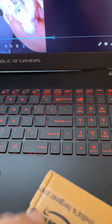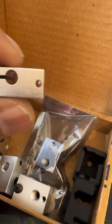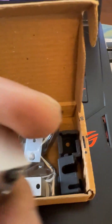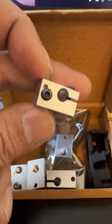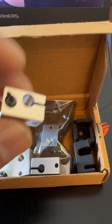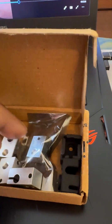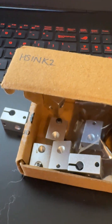I made this mistake so you don't have to. This is a heat block which takes the cartridge type thermistor, and here's the heat block which takes the glass type thermistor. I spent a lot of money just figuring this out — I ordered these, the glass type came, but I originally had a cartridge type. I removed the cartridge type thermistor and put a glass type on it with the glass type heat block. So don't make this mistake: be very sure if you have a glass type or cartridge type thermistor, and then order the heat block accordingly. Alright guys, bye.